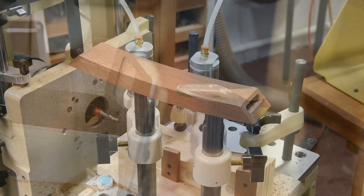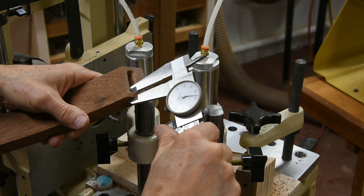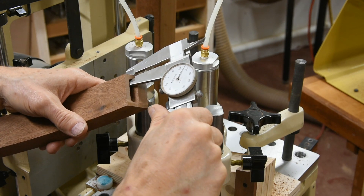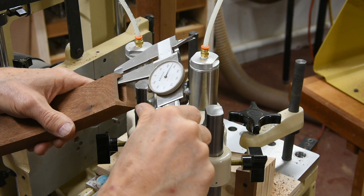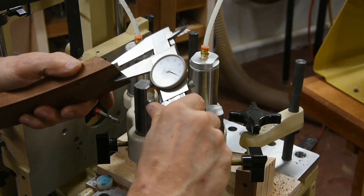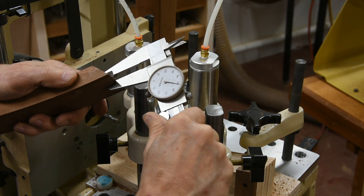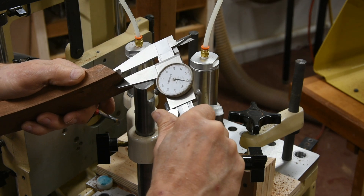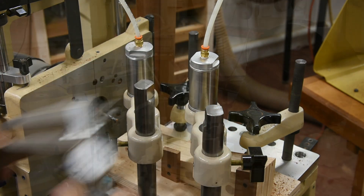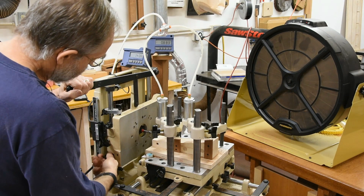Let's see what we've got. These are supposed to be in about 0.25 — that's 2.46 for that one, that's plenty good. 2.25, 2.26 — I need to bring that stop over 0.24. And this is supposed to be 3.17 — I am way off. Usually not that far off; that's unusual. I'm about 0.033 off. So let's go ahead and adjust using the ProScales and give it another try. Doing the math, my new number on the height here is 1.374.